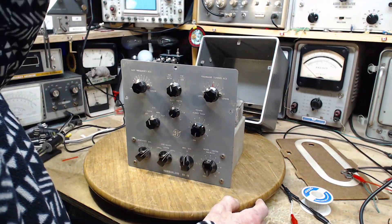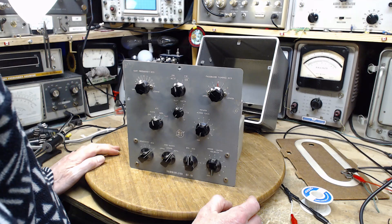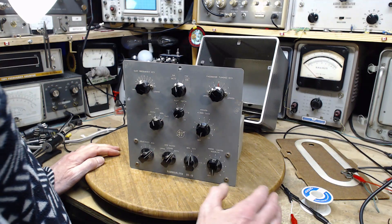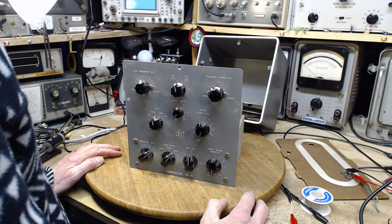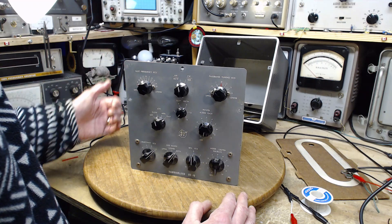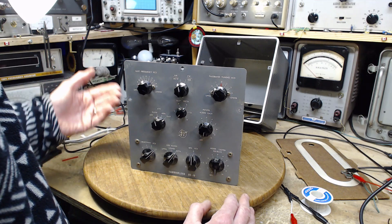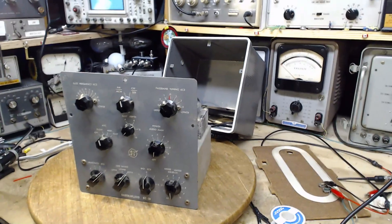This will not tune anything antenna-wise. So with the IF signal coming in — that's at 455 kHz — this has to be tuned very carefully to 455 kHz, and the radio itself has to have an IF operating at 455 kHz. If not, everything has to be tuned up to the exact IF frequency of the radio that you have this connected to. Then this signal comes in here, it's converted down to 90 kilocycles from the 455 kHz, and then runs through a series of IF amplifiers, gets detected, amplified, and sent out to the speaker.